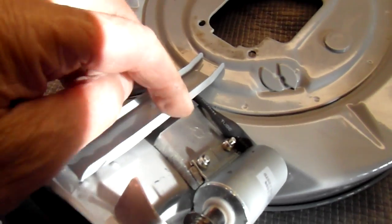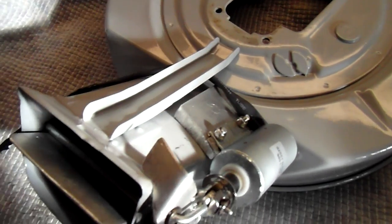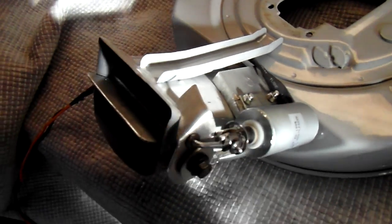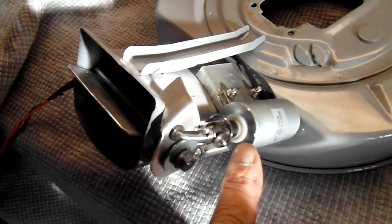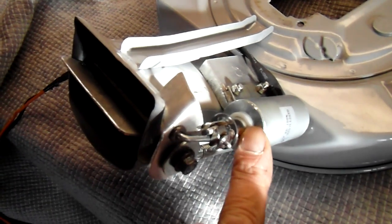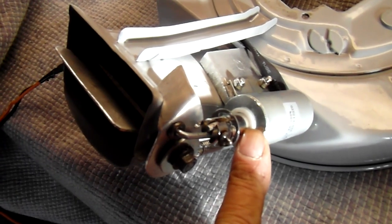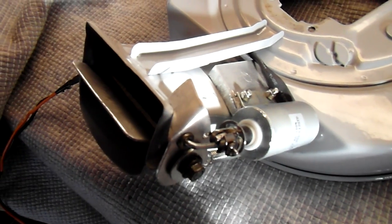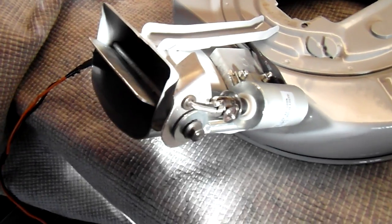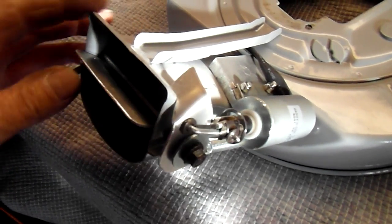The block on the back here — this is an aluminium block — is a heatsink for the solenoid. If you're doing this modification, it's important that the stroke on the solenoid is at least 19mm. A lot of the smaller ones are about 5mm which is far too short. This one is 19mm, which works out just right, so you get quite a bit of difference in the variation between the two positions.